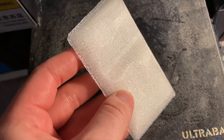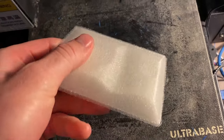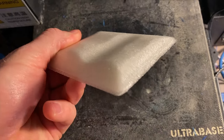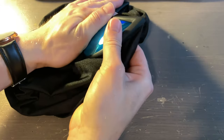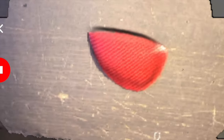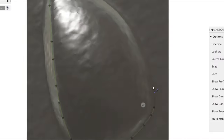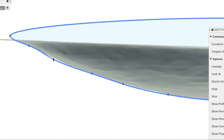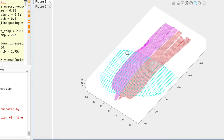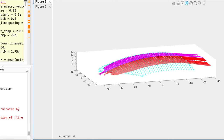I had achieved true non-planar contoured 3D printing and it was beautiful, but I still hadn't used it to make lenses. I started with a 3D scan of a lens that already fits into the frame of my mask. The reflective version messed with the 3D scan, so I scanned the red version I had made before and recreated the shape in Fusion 360. Running the STL through the slicer made clear there were initial problems — making a thin contoured part with edges that don't lie on the ground is a different challenge.